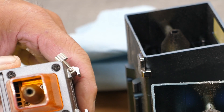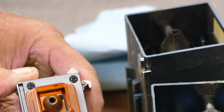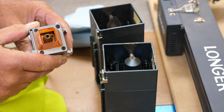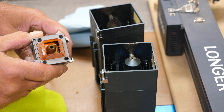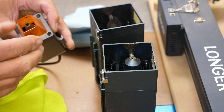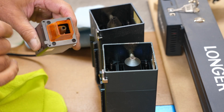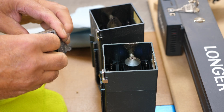It also affects the airflow. As far as actually cleaning the lens, when you're using air assist all the time you will not need to clean the lens very often. To do it on this particular one — the xTool — this unscrews.